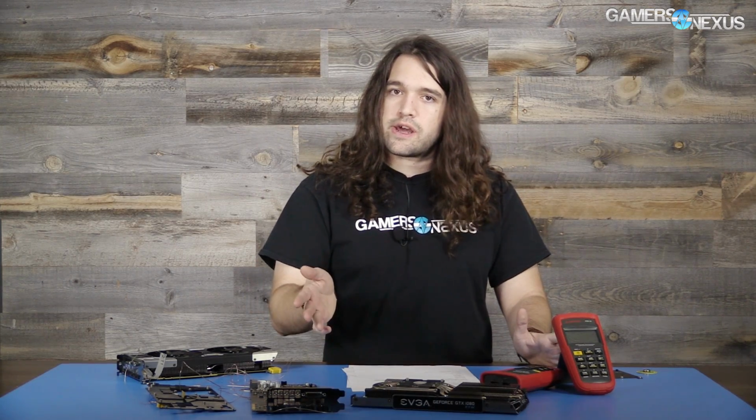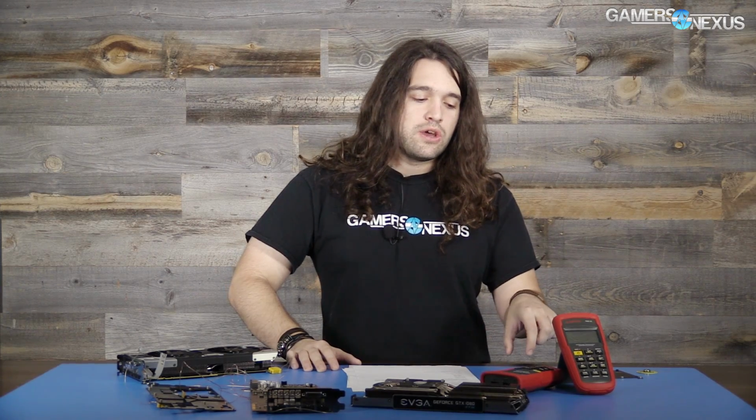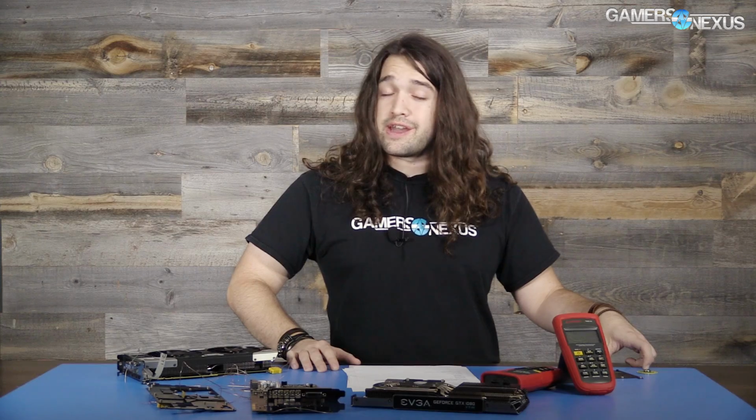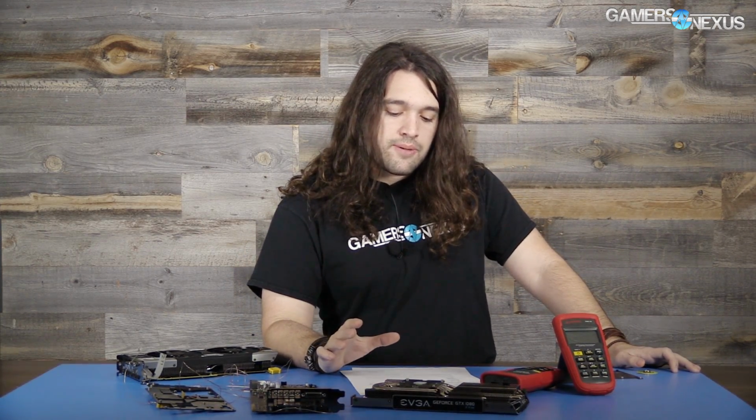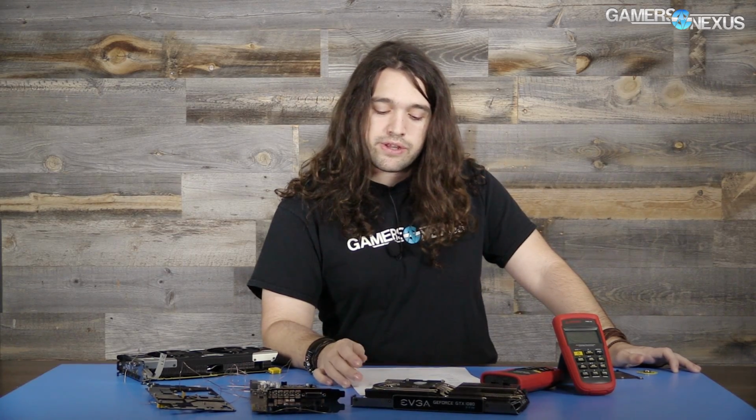If you had your heart set on one of these and these questions that arose about thermals made you step back and go, well, let me see how this resolves, you can probably buy it and be fine. Everything sold after November 1st will have the thermal pad replacement and the VBIOS update. Maybe there's a few items out there on shelves in small shops, but other than that, they're all updated at this point. Some were pulled back by EVGA and updated even after being sent to retailers. So I think that mostly recaps it. Assuming what EVGA told me is correct, assuming a 0.02% failure rate, this seems like a low enough occurring issue that you could buy one of these and still be okay.